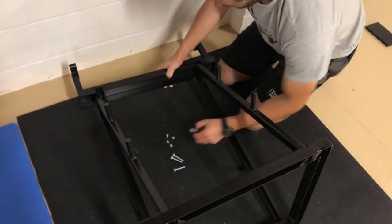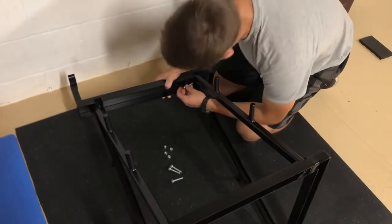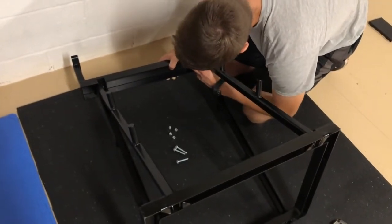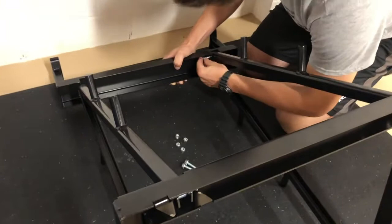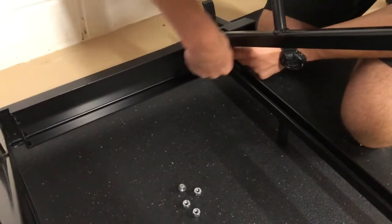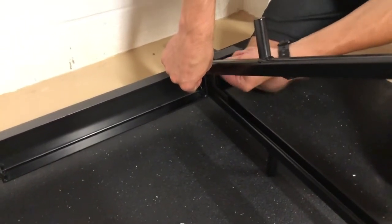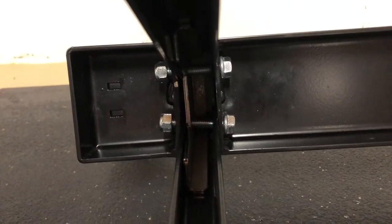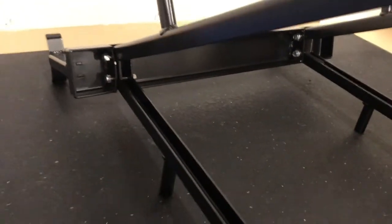The key part is that as you bolt the legs, you've got to bolt through that angle bracket. Again, the bolt head is facing towards the inside of the rack. Slot it all the way through and the nut goes on the other side. Here's a close-up view of that angle bracket installed. My recommendation is that you install all four bolts and just hand tighten the nuts so that you get all four of them in before you actually tighten them down with the wrenches.